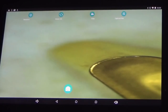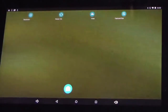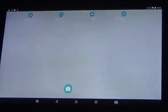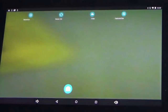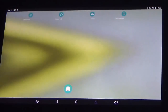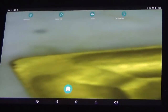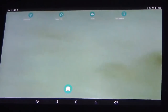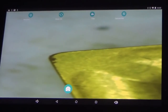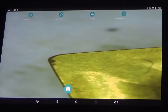Same deal, blunt edge. And you might say, John, this is because you're using big inserts. You know, they're all great big inserts. So we're going to look at a tiny insert now. So this is a tiny SNMG square insert. And I'll show you these inserts in a minute on the table. But we'll just have a look at that. And I can't even tip this one up because it's so small under the microscope lens. But guess what? Same deal. Rounded off or blunt cutting edge.